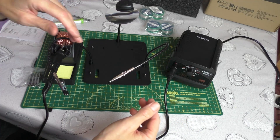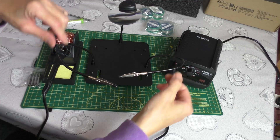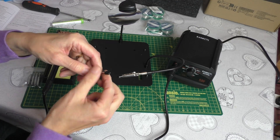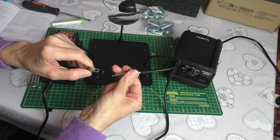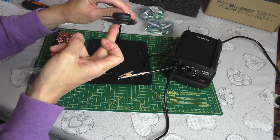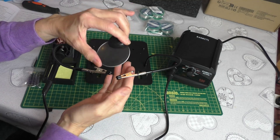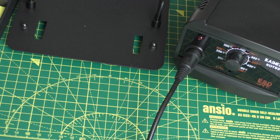The base itself is made out of metal, which is quite nice, and it does have these helping hands - I think that's a real bonus. They flop about a little bit, but I might unscrew them and put in a washer just to tighten them up. They have a protective piece of plastic on the grips which will stop them damaging circuit boards. You also get a little magnifying lens - looks about five times. It's a bit small and there's no LED light, which is a shame. The iron has now warmed up to 375 degrees and we're going to tin the tip for the first time.